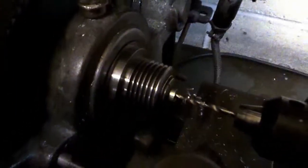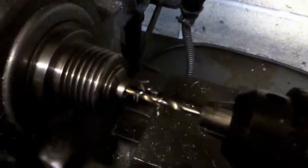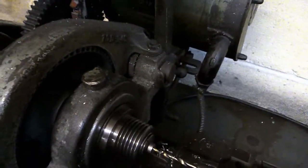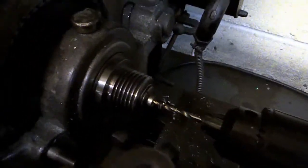I've got a slight problem that the bar is pushing back in the collet, so I need to tighten it up a bit more. This is stainless steel — we could possibly go a bit faster as well, but I think the speed is okay. I only need one little hole; I just need it tightened up so it doesn't push back in the collet. Let's have another go.